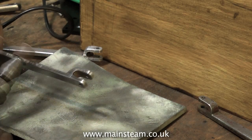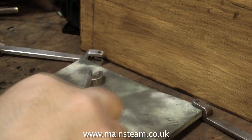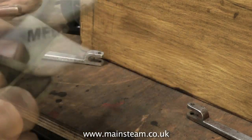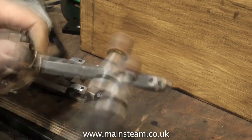So it's a repeat process. I'm using my little mini drill with a drum sander to get through the deep part of the damage, and then I use some medium sandpaper followed by fine sandpaper. Somewhere in between I'm using a needle file to draw file the really deep damage.